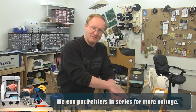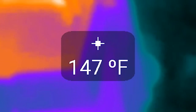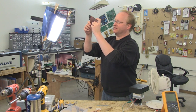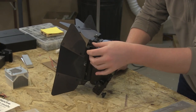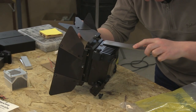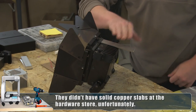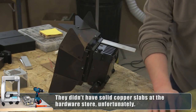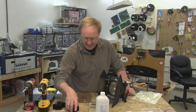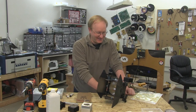The next thing I want to check is whether we can get these temperatures off one of our shop lights. They are very warm — the back of the chassis is about 150 degrees, but up at the top it's nearly 400 degrees, and that's going to be this piece of metal right here. I think that's a pretty good place to attach the Peltier — this was the warmest part when we looked at it with the IR camera. I don't have big copper pieces, that would be expensive, but I do have steel. My thought is maybe we can slide the steel so it picks up heat from several surfaces like right above the light and the chassis, then put the Peltiers down here far away from the light.